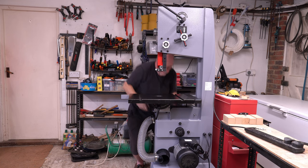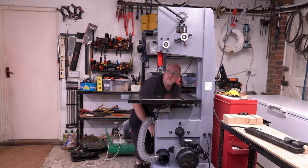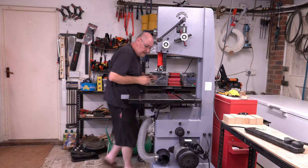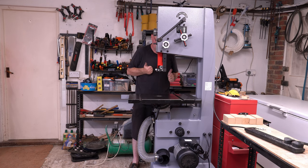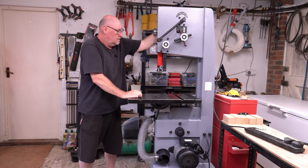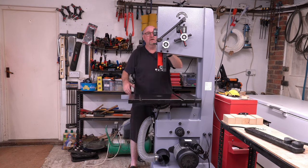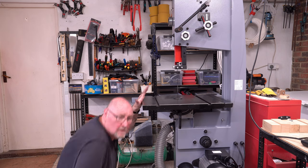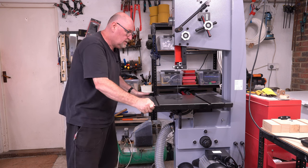That's on the top wheel, going down and it's on the bottom wheel. Put the tension on by pulling the lever down — I love that feature. The piece of wood goes back in; it's there for dust extraction, which is a good idea. Spin the wheel round so the blade centres itself — with the machine unplugged, of course; don't do this with the machine plugged in. That's the blade fitted, I can shut the door now. I've been around and tightened all the little hex bolts — just snug but not too tight, so the table isn't moving around.